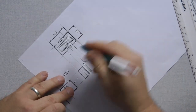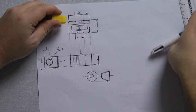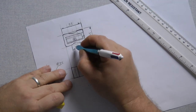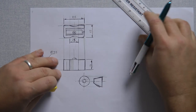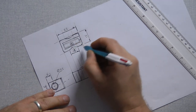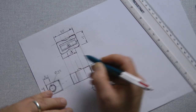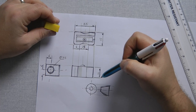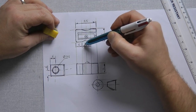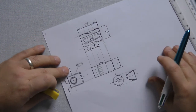I haven't shown where this groove comes, so I'm going to indicate that here because I think it's quite important. The width of that groove — the indentation — is 13 millimetres, and I could indicate 6 at that point. Now, if I've got 25 mm overall, and 6 there and 13 there, I don't need to indicate that last bit. If you don't need to put a dimension on, don't do it unless it makes your drawing clearer.